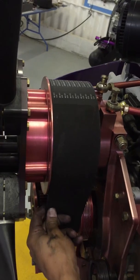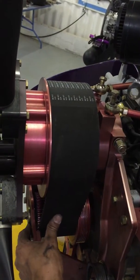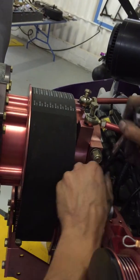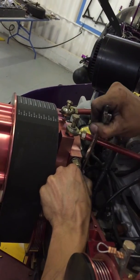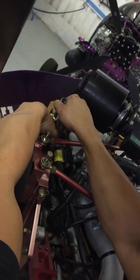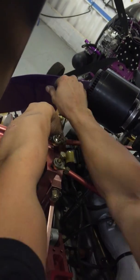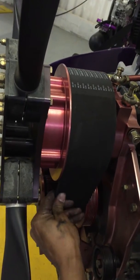And as soon as you've tightened the top one, you'll feel that the tension down at the bottom is 1.5. If the tension's too much, redo these and then just set the tension on the eccentric again. And you can tighten up the three bolts on the horseshoe. Hand tight. There we go. Same on that side. There we go. And your tension on your belt is set.